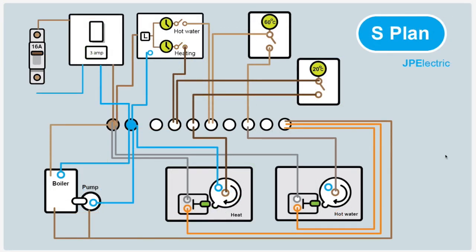This is the S-Plan with all the conductors in, apart from the CPCs. It starts to look a little bit complex, but as we know, it's not really — it's just a series of switches. When you look at each section logically, you can see what it's doing. It's not that complex when you see it in a nicely organized drawing like this.